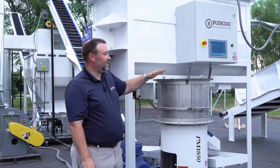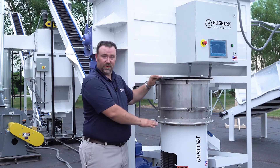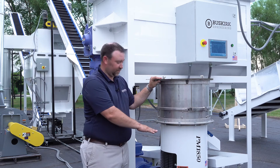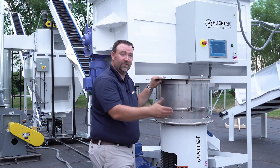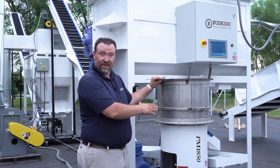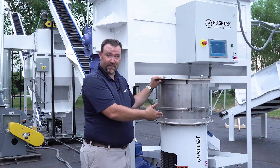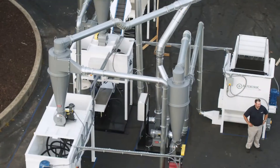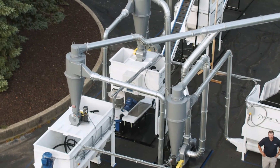As that comes through, it's fed by an auger into our PM1850, the heart and soul of our pelleting system. This pellet mill can be expanded to two to three pellet mills depending on the customer's needs. With hops, this will do a thousand pounds an hour, and fertilizer will do up to two thousand pounds an hour. If your needs are six thousand pounds an hour, we can provide that with the same footprint.